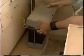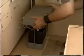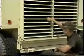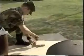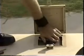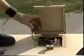Batteries and cables are often overlooked during pre-operational inspections. Check to see if they need to be serviced. Low fluid level and loose or corroded cables cause most battery problems. Make sure the radiator is not leaking and verify the coolant is at the proper level. To accomplish this task, you must climb on top of the generator set.